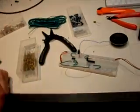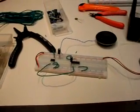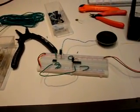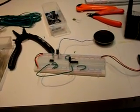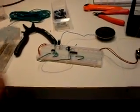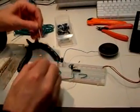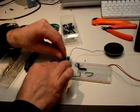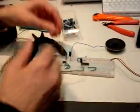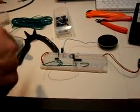Now let me show you a couple of other things about the amp. I'm not lying when I say it's a cheap amp — it works really well, but it's noisy and it can easily go into self-oscillation. One way to prevent that is to put a capacitor between pin seven and ground — about 0.01 microfarads. That's a modification to make the circuit more robust, though you don't have to do it. It may prevent the circuit from going into oscillation.